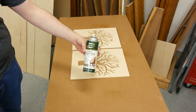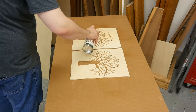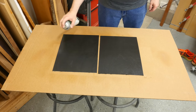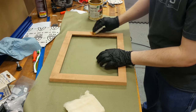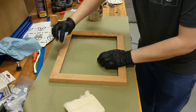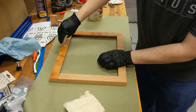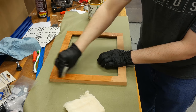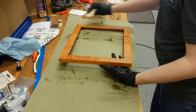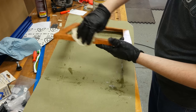After the ink dried, I sprayed two coats of a water-based poly on both the artwork and the backer board. Next, I finished the frames again using the stain pad applicator. I applied a coat of Osmo Polyx and after a few minutes of letting it soak in, I removed the excess finish using a cheesecloth. I didn't want a flashy, shiny finish for the frames, just something to darken the cherry and walnut with a satin-flat appearance — I wanted the artwork to do all of the talking.